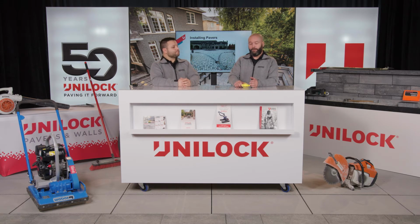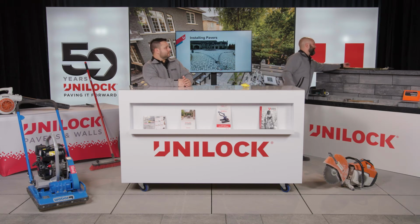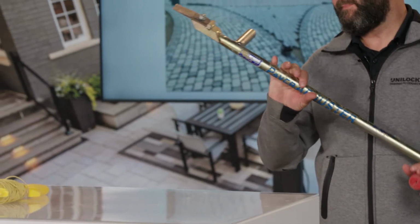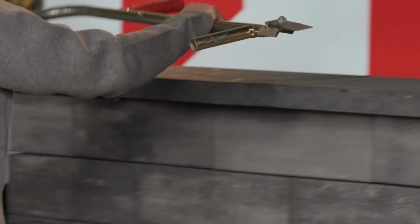Right, and if you do run your string line and you notice that you've gone off course a little bit, we have a paver adjuster here. This is a really great tool, allows you to stand up and then just do minor adjustments to move your pavers back into place. And the portion of that tool that actually goes in between the pavers is much wider than, say, a Phillips head screwdriver or something like that.